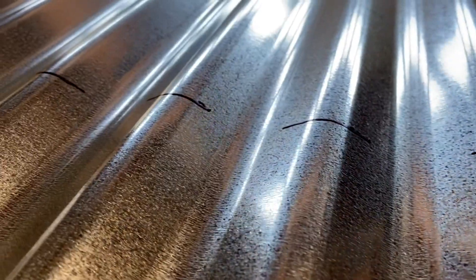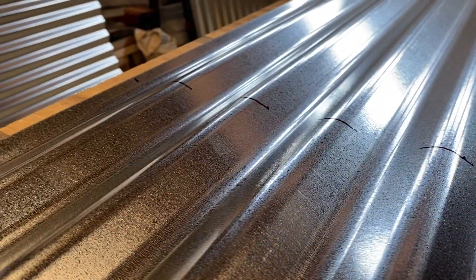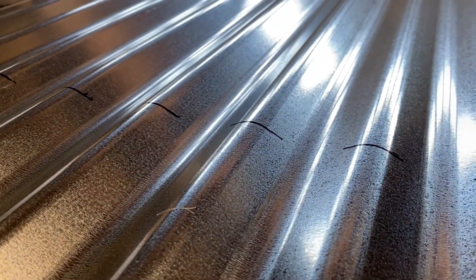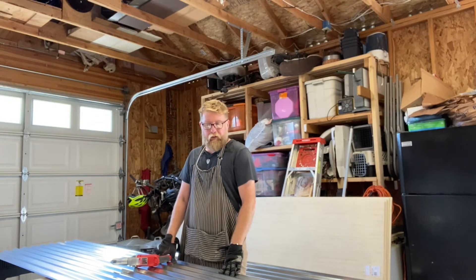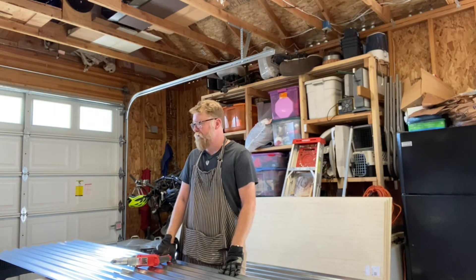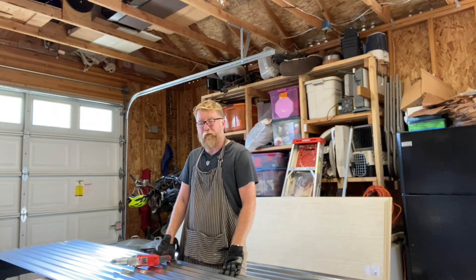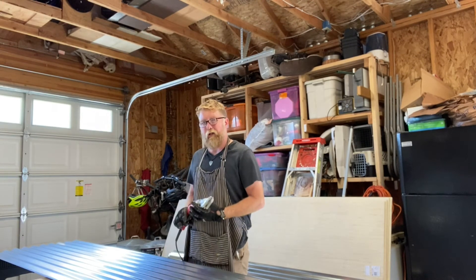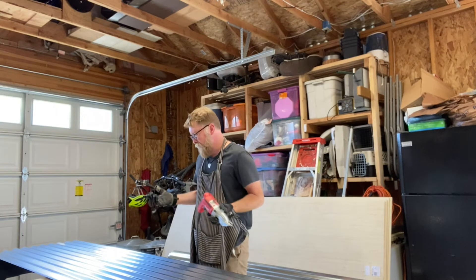I just wanted to clarify how we made the marks. As you can see, I made them on the rise, not the valley. And because it's galvanized steel, I used a Sharpie because the pencil wasn't making the marks dark enough. Earlier in this video I was saying that when I was cutting I was going slow to try to be as accurate as possible. But over the course of cutting a couple dozen pieces, I realized that doesn't really matter. I found that if I run the shear at a higher RPM, it actually cuts better. So I just wanted to show that real quick.